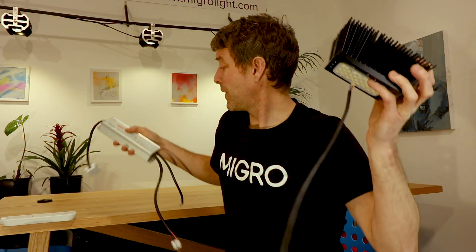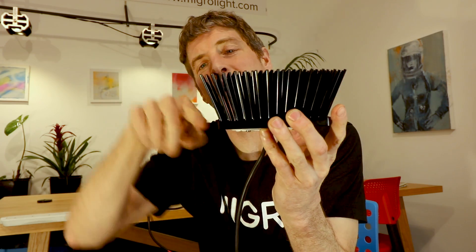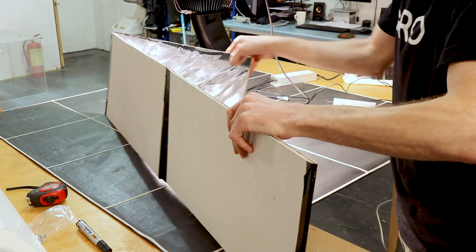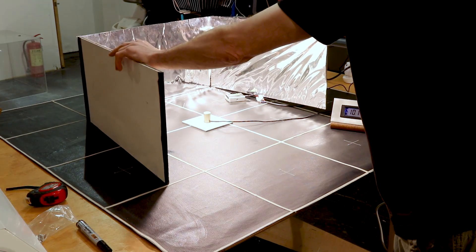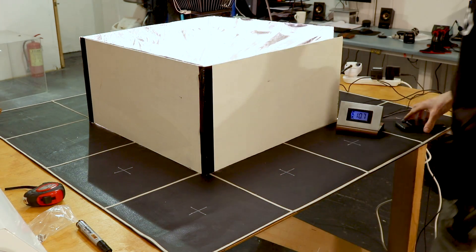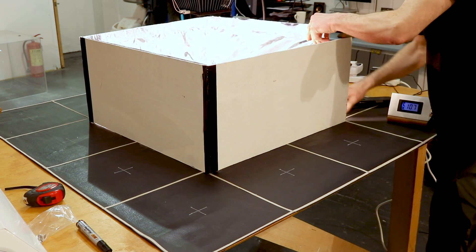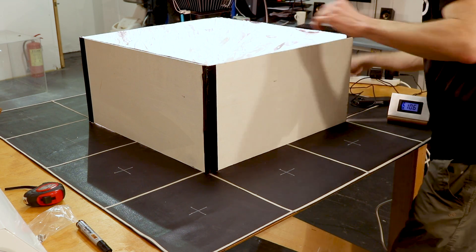Connected it all together and hung it up. There are not great hanging fixtures — you can see them. There are two holes on each side of the pin-fin heat sink and you've got to hang it from there. Because the heat sink kind of comes around, you can't hang it simply — it's got to come out and around, so you've got to mess around with it a bit. I just used steel wire cables to hang it up for the test. Next was to figure out how high to hang it. Using the 60cm by 60cm, 2ft by 2ft test area with mylar walls and calibrating it so that the centre measurement — the peak PAR — is at 1000 PAR. Set it up at 27cm off the grow area and started testing.